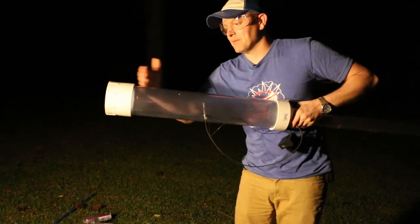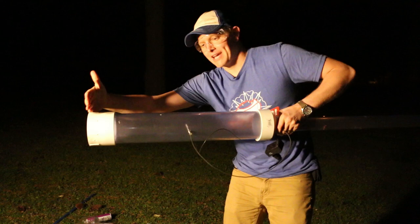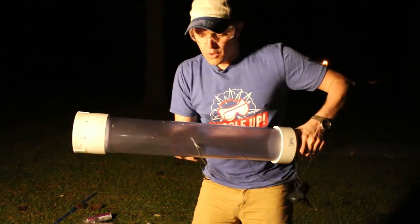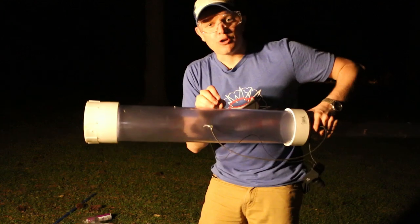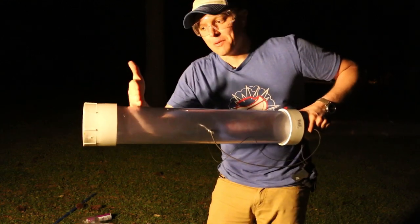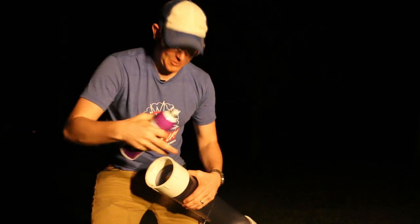When we first start the combustion from the end, it's a wave. You've got an oxygen-fuel mixture that goes all the way down the combustion chamber. When we start right in the middle, we start to expand and use that fuel and that oxygen, but we run out of oxygen before we burn all the fuel. We're going to shoot this thing from the end and zoom in with a high-speed camera directly on the combustion chamber to see if we can see that flame front moving.